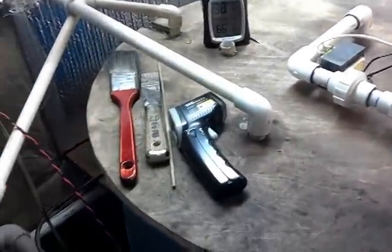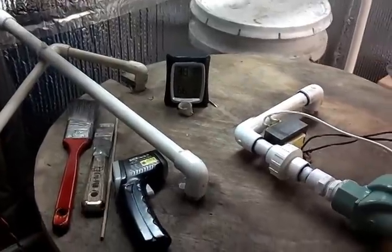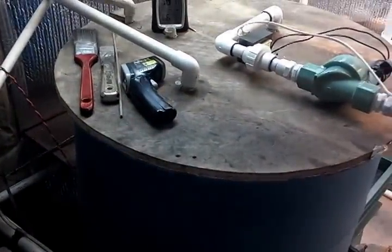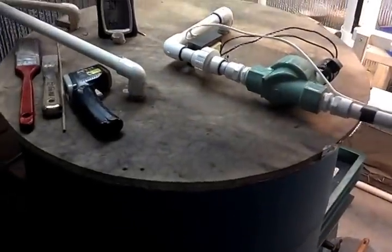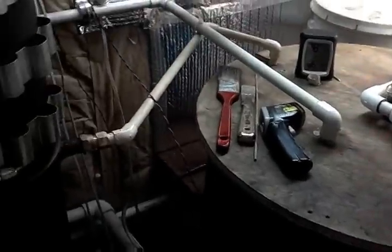As I said in previous videos, this line here is the water coming in from my fish tank. It goes into a coil of corrugated stainless steel tubing — the kind used on gas lines in a house — that sits just in the top of this barrel. The coil is only about a foot long and a foot in diameter. As the heated antifreeze and water comes back in at the bottom, it rises up through that coil, heating the fish tank water pumping through it, which then returns to the fish tank entering at the bottom so the heat rises and warms the entire tank.